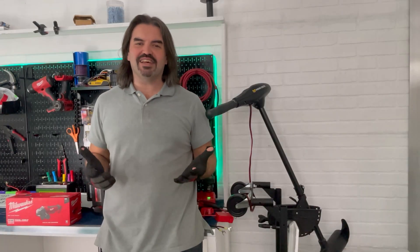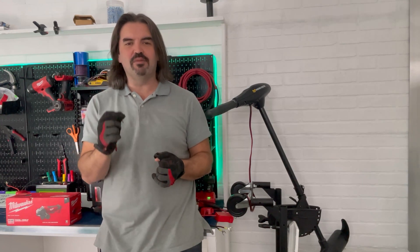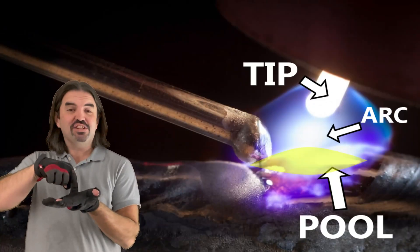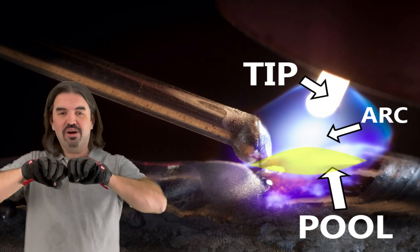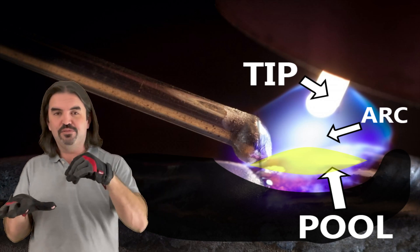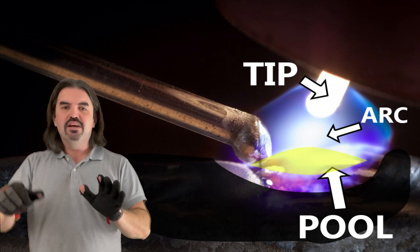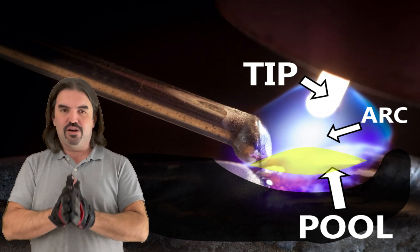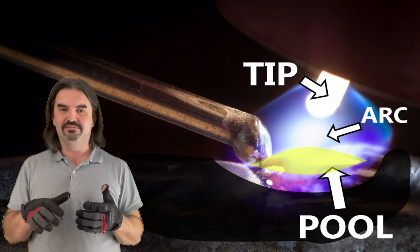After a week of practice, I hit my stride very suddenly, because for that entire first week I was making a very common beginner mistake — it's called tipping the tungsten. If your tungsten tip touches the pool, you're in trouble, because molten metal is going to suck up onto the tip, and then 200 amps of current is going to spray char marks all over your part. So as you weld forward, you're going to be trying to weld through char. What you need to do in that moment is stop, clean the part, re-grind the tungsten, and go again fresh. But I did the opposite of that over and over again — I welded through that char with the dirty tungsten again and again.